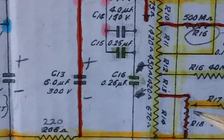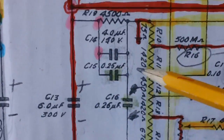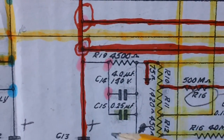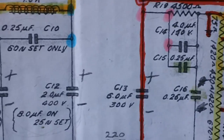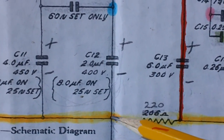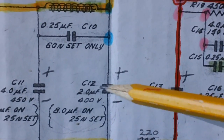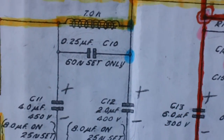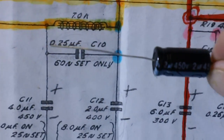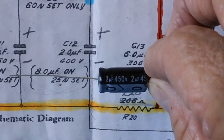Now, later on, we'll connect the brown wire on this side of the resistor to all this up here, but that'll probably be done in the next video. Today, I just want to get that wire hooked there with that 500K resistor, and also get this 2 microfarad capacitor in, which is right here, this little 2 microfarad capacitor.